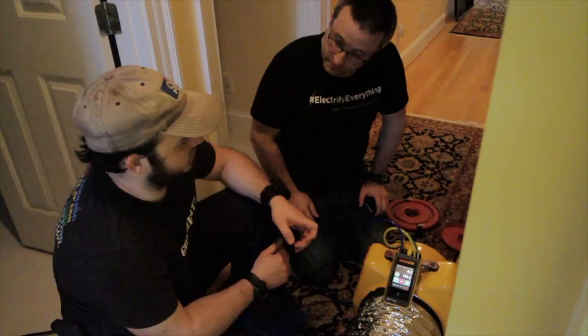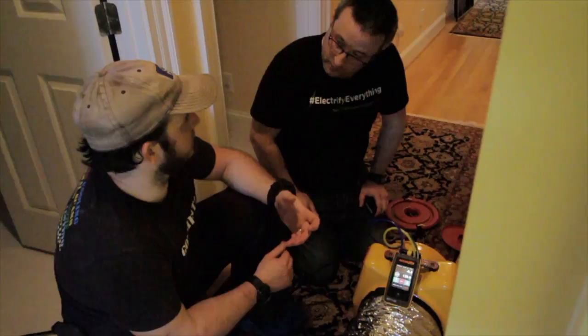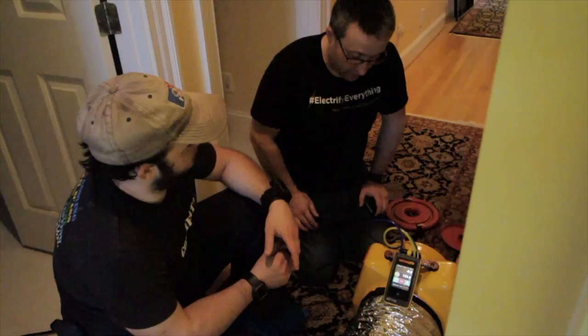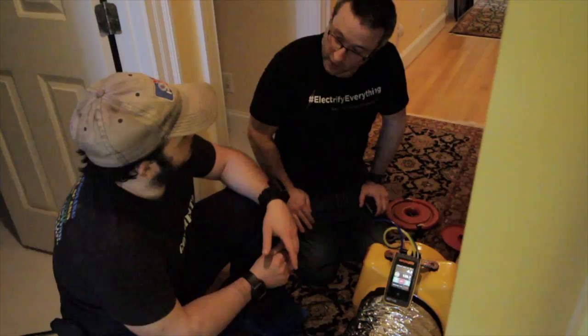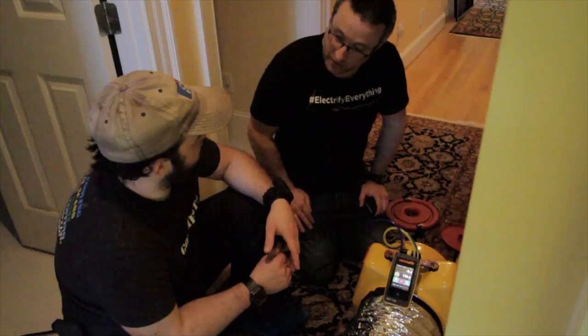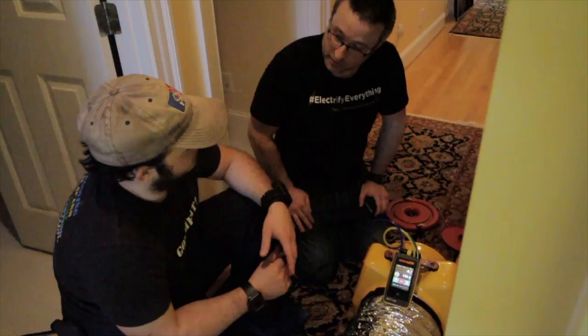Okay. So it's 1/14th of leakage, basically. About, or 1/10th, maybe. Almost 1/10th. Yeah. So 1/10th of the flow of the system is actually going outdoors. Yeah. Okay. That's only 10%, right? 1/10th? Yeah. But 10% is obviously significant. That's going to suck a lot of outside air to replace it. Yeah. So, that's putting the house under some pretty severe pressure.